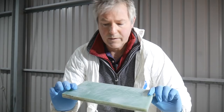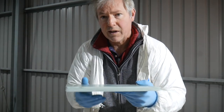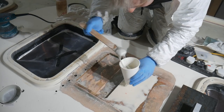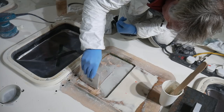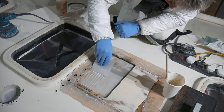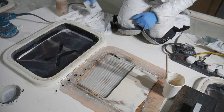Okay, so here's the final product, finished and ready to go. It's about 15mm thick - there are three pieces here. I've just ground off a little bit of each side to get a slight slope to help it curve around the coach roof, and I've scored it up nicely so it's got lots of grip. Now it's just a matter of bedding it down. It's been a while since I've done this - putting core down. I'll need a fair bit on this side because there's a real dip here, and then a bit thinner over here.